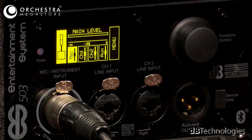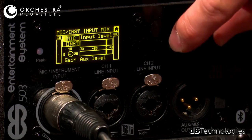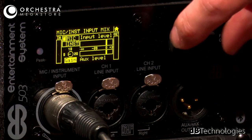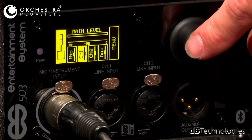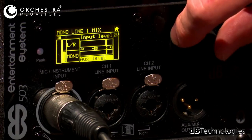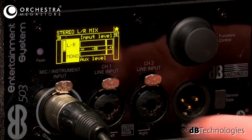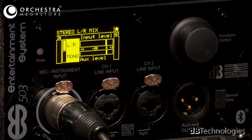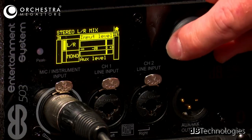The DSP is quite simple. You have access to each of these inputs and gain for each one. Going into the microphone input, you have access to different gain settings for the mic preamp. Beyond that, you have the balanced inputs — channel one to set its level, and input two to set its level separately. For a stereo signal, channel one (left) goes into balanced input one, and the right signal goes into balanced input two, setting up a left-right signal configuration.